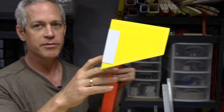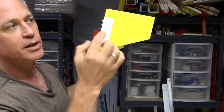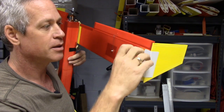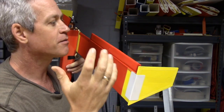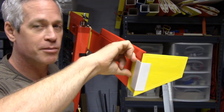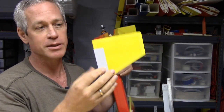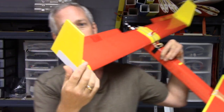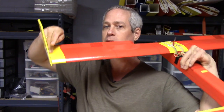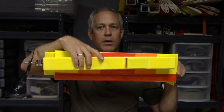In this iteration of the plane, I've used a folded gift card to fix the vertical stabilizer. It's two-sided foam taped here and here, and with a little application of dust-off in its liquid form to chill that tape, it can be plucked right off. You could also hot glue it or Gorilla Glue it — it's actually remarkably strong.